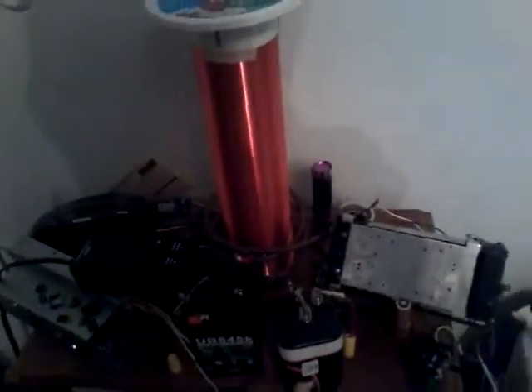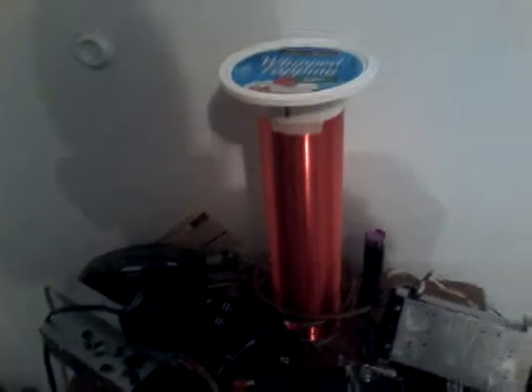Where an interrupter you can actually adjust the frequency. This is actually my second solid state Tesla coil. My first one used a really small one — it was about this tall and used a little bitty transistor, 2N2222 transistors. They're a pain in the butt to deal with, so I switched to this really high powered MOSFET — that's my extra one.